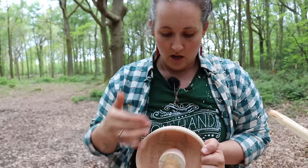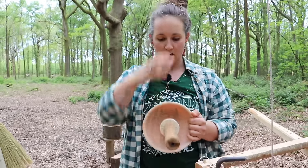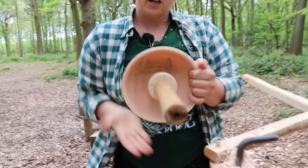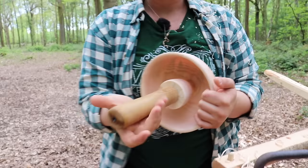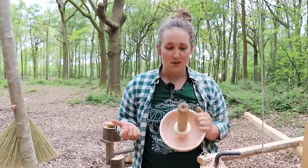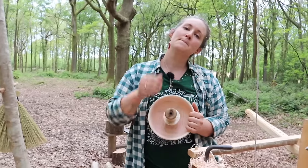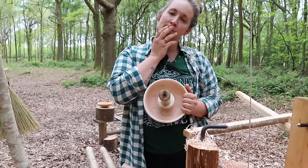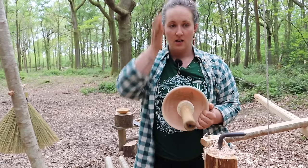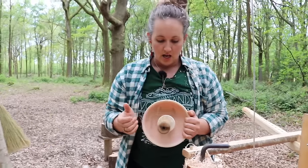And what I want to do is I'm going to make the bowl standing in front of me as if it was in the tree. So I can see the rings here. The end grain is on the top and bottom. And I'm going to take this and I'm going to pop the core out. So just to reiterate then, the grain is going down, and you're pulling the opposite way. Yes, I'm pulling across the grain with it standing as if it was standing in a tree, still alive.